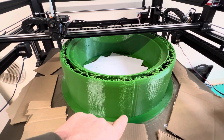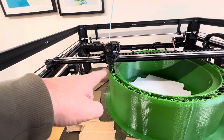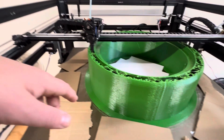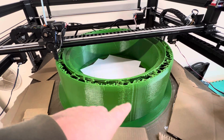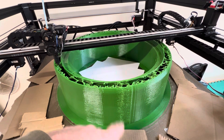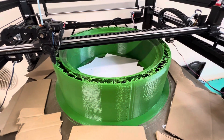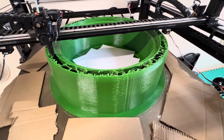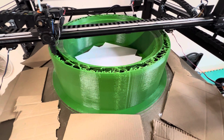That's effectively sucking air back up into the Goliath, which does have a really long heat chamber because it can handle so much heat capacity. What that means is the material is actually coming out burnt and bubbling when it resumes each lap of the outer wall. Getting rid of stringing with a heat gun is pretty easy on a part like this, and most of the stringing ends up internally since I'm printing the internal wall before the outside wall. So I'm going to recalibrate for the next piece with much lower retraction levels so it's not popping and bubbling on the start of each lap.